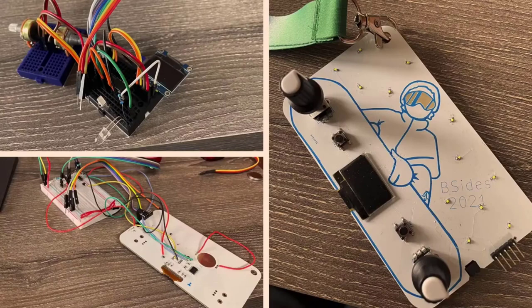Here's my iteration process from design concept to the final badge. The top left image is my first initial design — it's got two little breadboards. That main chip's on there, and you can see the LED, my IR sensors, and my two pots on the blue board. I just kind of breadboarded it out: can this chip do what I want to do? Can I receive IR messages? Can I write to that screen fast enough so it doesn't look clunky?